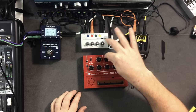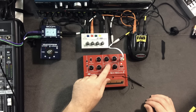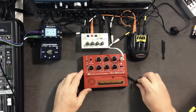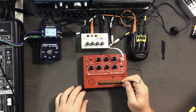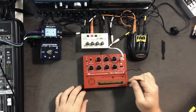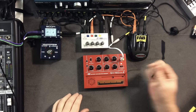A lot of guys, that's all they really need. We have an LFO rate, depth, and some attack and decay. And that's pretty much it. Now, the input for this is a stylus, and you run the stylus down this little ribbon. So there's a noise right there, and it makes an electrical contact. And the further up and down you go on this black strip right here, it changes the pitch frequency. And there you go with that.